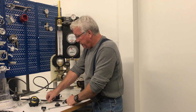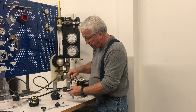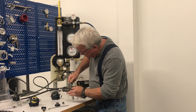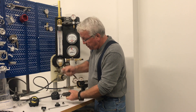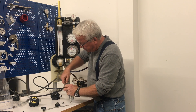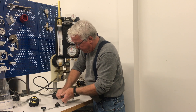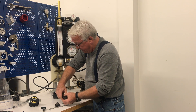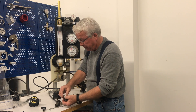We have a first stage handle for low pressure or high pressure ports so we can hold on to the regulator. We'll screw one end of this into the first stage. Then we can use a number five hook spanner with pin to separate the two parts of the first stage — the environmental chamber — and here we have the piston, it's a flow-through piston, and your spring.